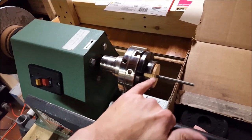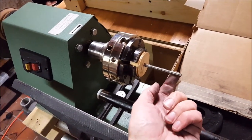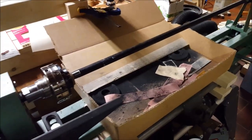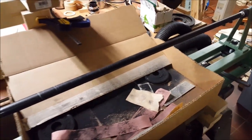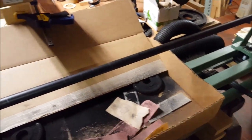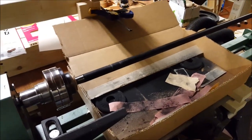For this side, we've just got a block of wood with a center hole and some quarter-inch all-thread that slides into here. Then we tighten it down. These are 36-inch sections and we've got this mounted on there — very easy, very fast. Turn on the lathe and we're good to sand.